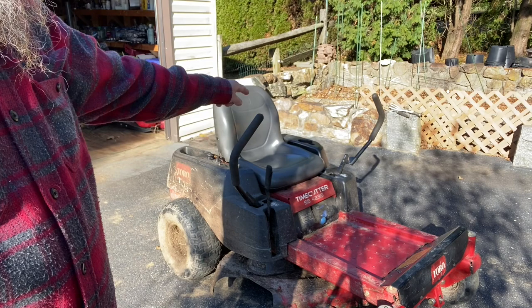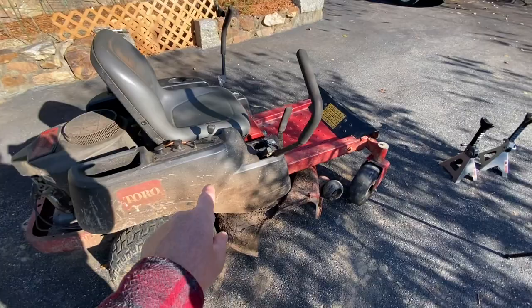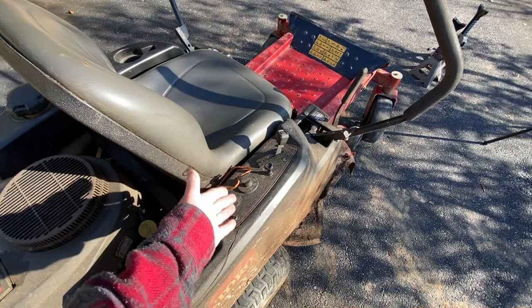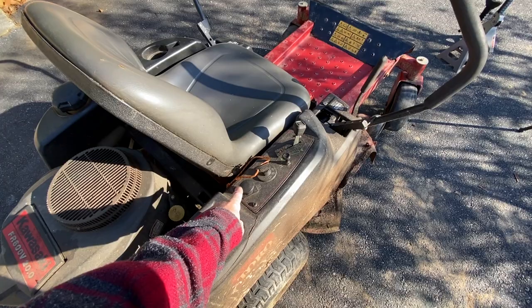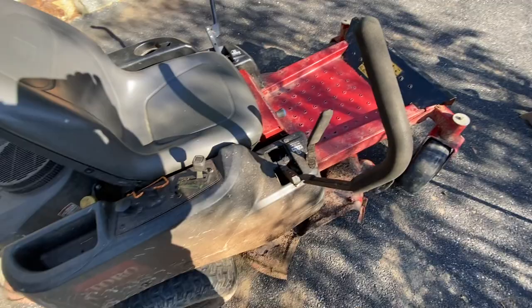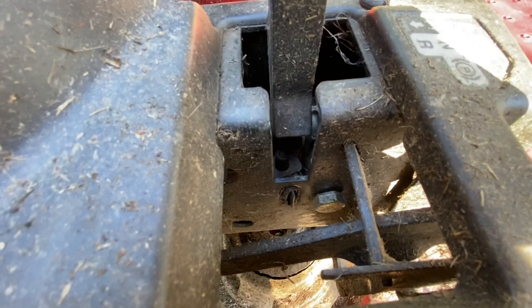So it's the handles — it's one of the switches on either side of those handles. I started the mower sitting on the seat, handles out, pulled up my PTO and the blade runs perfectly. While the blade's running, if I come off the seat it shuts the mower off — that's what it's supposed to do, so the seat safety switch works fine. The other switches are in the handles, and you can see right here if I move this handle forward there's a little safety switch down in there.